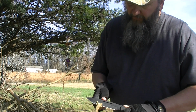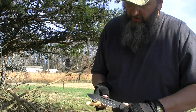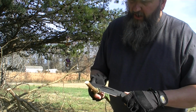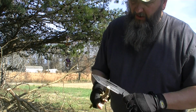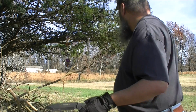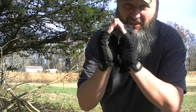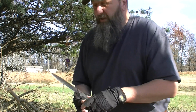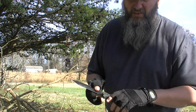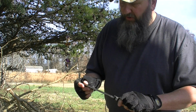Sometimes when you get a knife, you want to adjust the edge of the grind of the blade, the actual edge, to a better grind suited for what you like. And for me, I like a convex edge more than anything, and a convex edge is like this, and it's stronger, but you're not going to get anything better for dealing with wood than what you'd see almost more as a Scandinavian grind. But we're getting into all kinds of different videos there, so for another day.